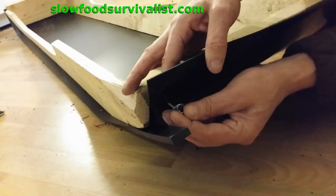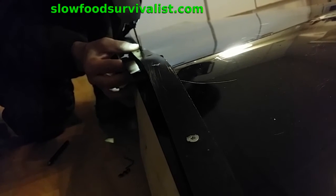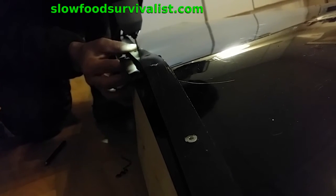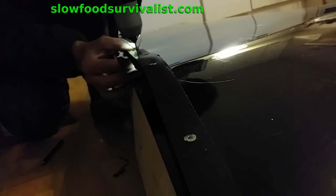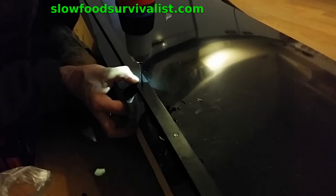The easiest way to attach the bottom and the runners to the frame is to begin with screwing the plastic sheet to the front end of the frame and then attach the runners together with the bottom sheet to the side panels. For that, it is necessary to first use a thin drill bit for holes for the screws, and then a bit thicker drill bit to make sink holes for the countersunk screws.